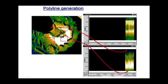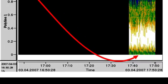The resulting chronological display of the local temperature distribution offers a fast and reproducible geometric indication of the main burner flame patterns as well as of the conditions in the sintering zone and the clinker bed. Even smallest flame variations are visualized. The time axis can be changed, and so the polylines can be displayed in this diagram over a few minutes or even over days.